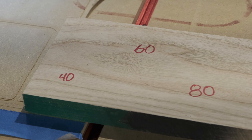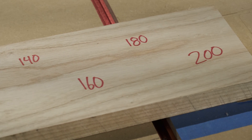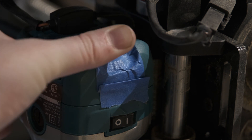So let's jump right into it. Depth of cut is going to be an eighth of an inch. I've got a step-over set at 0.225, which is what Carveco recommended, and we're going to start off at 40 inches per minute and go all the way up to 200 inches per minute with 20 inches per minute increments.